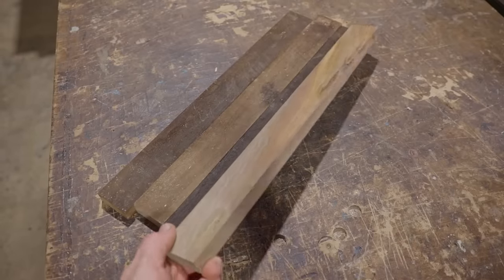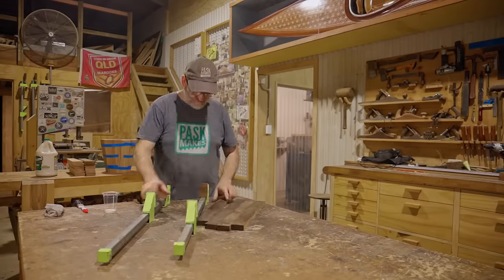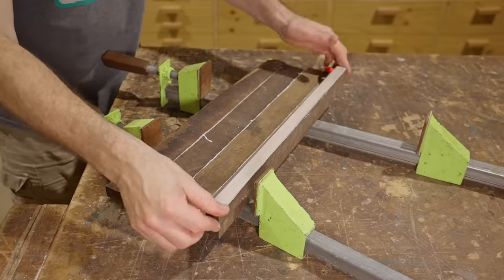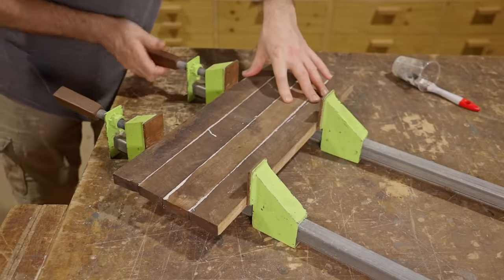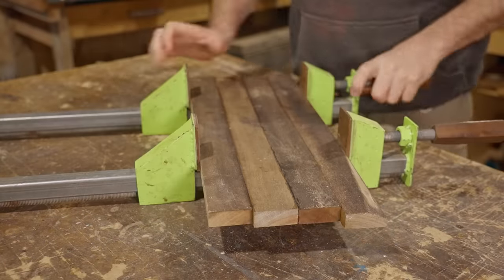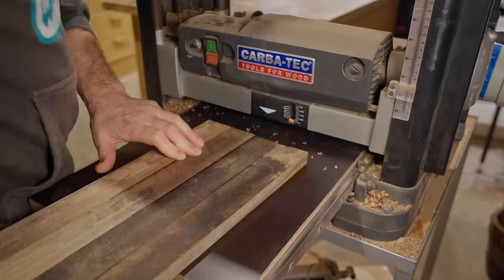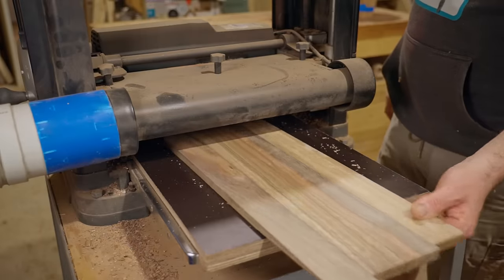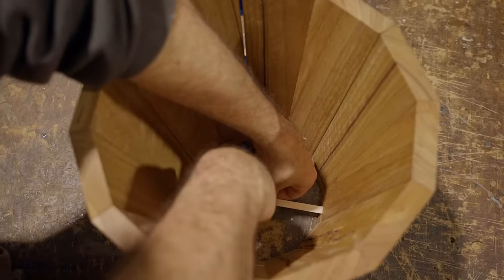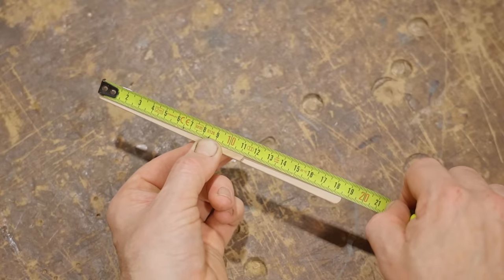For the bottom piece I'll use the scraps from cutting the staves at the start of the video. They need gluing together and I'm using waterproof glue for that. I do still have a few offcuts of garden sleepers so I could have made the bottom out of one piece, but I just like the idea of using up these scraps. I planed the board down to 12 millimeters or half an inch, then I'll measure the size needed for the bottom pieces. For the original bucket I made the bottom round and chiseled the groove in the staves to match, but I think a better option will be to just make a 12-sided bottom to fit.